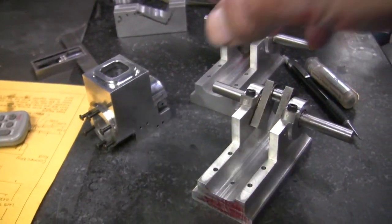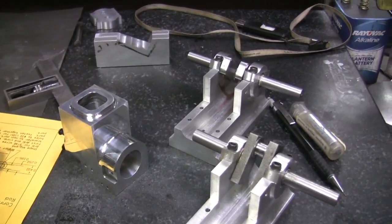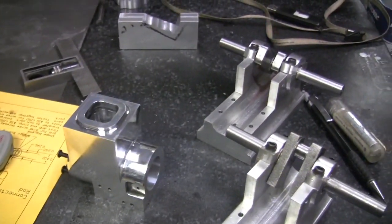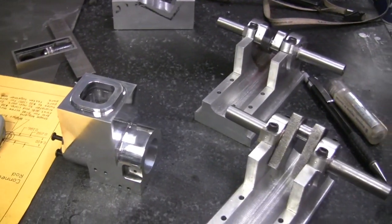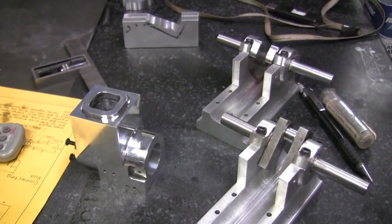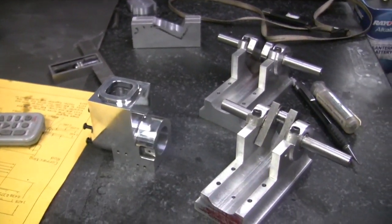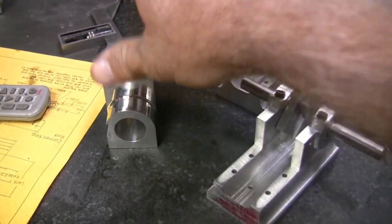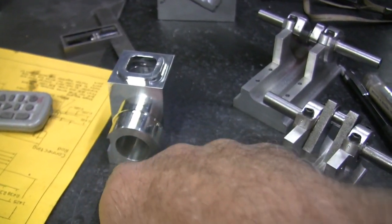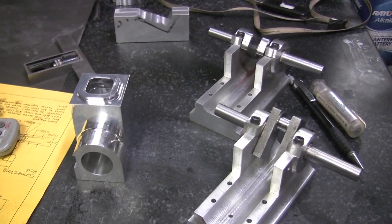Well, I'll decide that when I get there, but I'm going to go ahead and round up material for the cylinder sleeve. I'm not going to make it out of cast iron. I could have just made them out of aluminum, because that's what my Mini Hog and some of the other motors that I've made have. Aluminum cylinders work just fine as long as it ain't dead soft stuff. And all the stuff that I have is 7075 T651, which is pretty much as hard as cold roll steel. So anyway, I'm going to line up either some aluminum or some cold roll steel to put in the liners. I don't think I have any stainless that size.